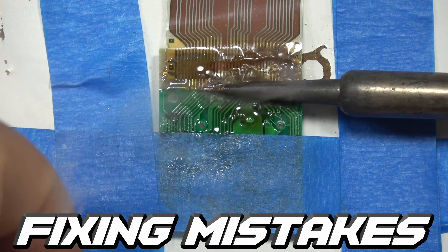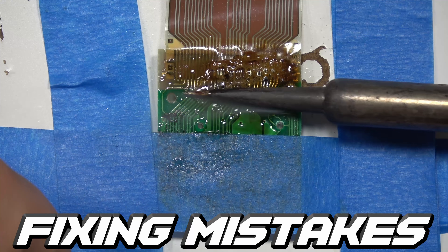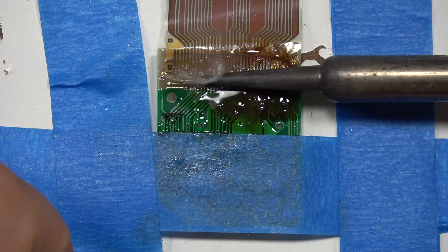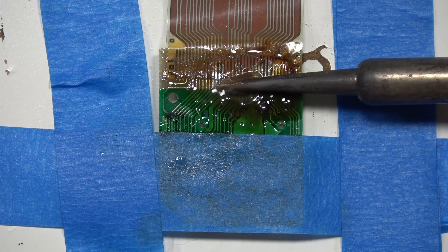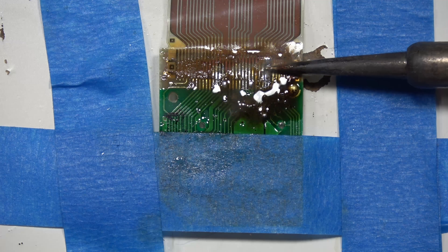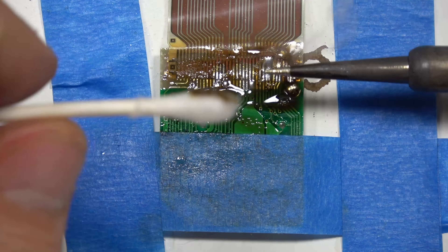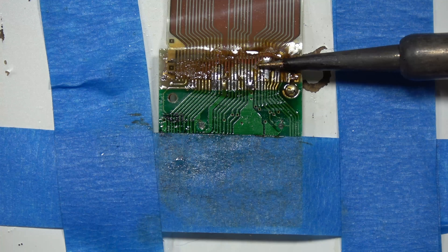The first thing I did wrong was use too much flux — you can see it all bubbling, which is why I said use a little less flux. I'm still doing the same back-and-forth horizontal method only on the bottom, and then on the top I started to flow down a little too early. Because there's too much flux I'm not cleaning it as often as I should be, and most importantly I'm not cleaning my tip. Right there I just bridged it because my tip had solder on it when I went to flow — it bridged because I wasn't cleaning it enough and had too much flux.